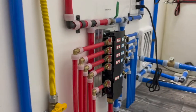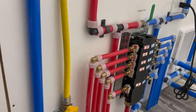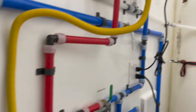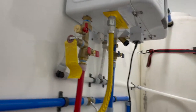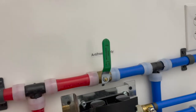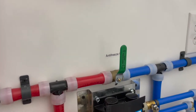Inside the manual it will tell you what those numbers represent. When you first operate the trailer you'll get the propane tanks filled and you'll need to turn on all of the plumbing valves including the propane. The propane comes in through here, so this should be turned on — that powers your hot water on demand tank. All of the plumbing valves should be turned on. The only one you do not need to turn on is clearly labeled anti-freeze only, and we will go over that later.